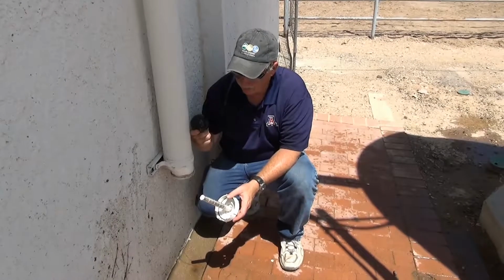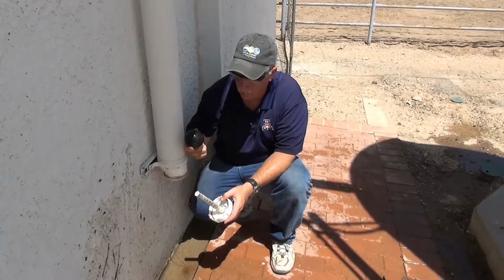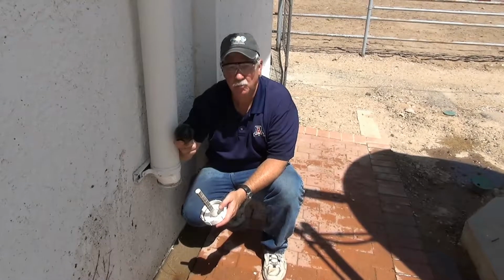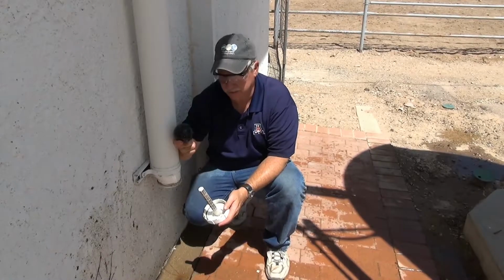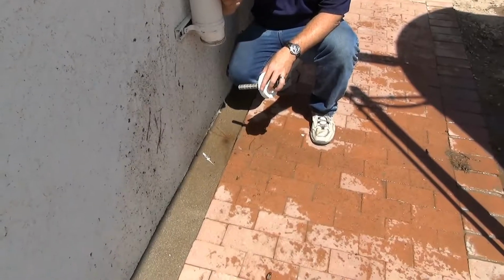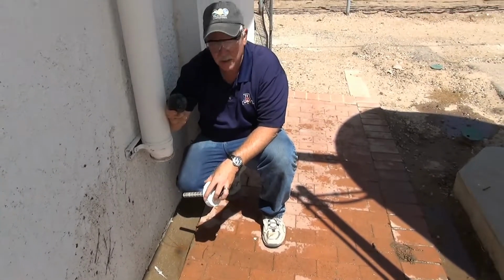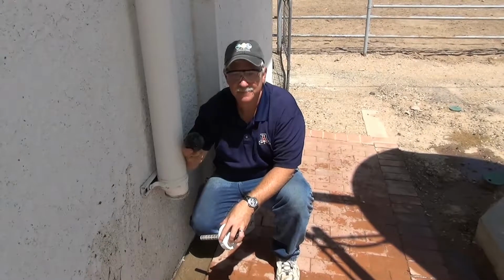When the water has filled up to a certain point, this black plastic ball floating on the water seals off the system. Any additional water coming into the system is then transported into our storage cistern. This keeps our cistern clean and removes any debris such as reptiles, sediment, or vegetative matter getting into our system, which may end up clogging our irrigation lines.